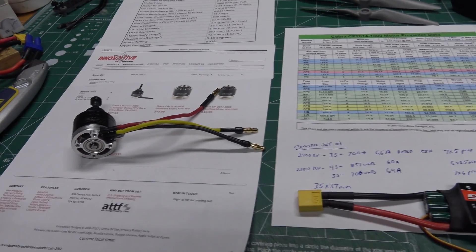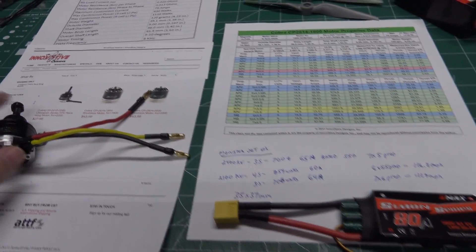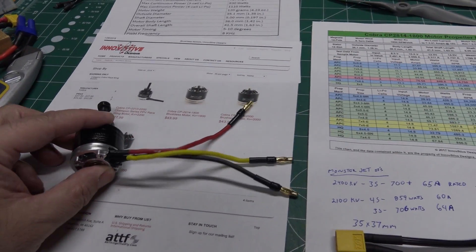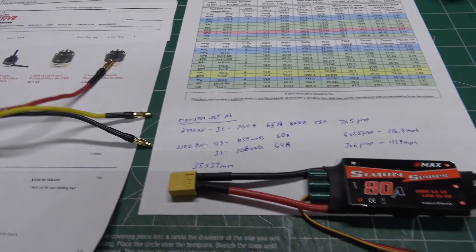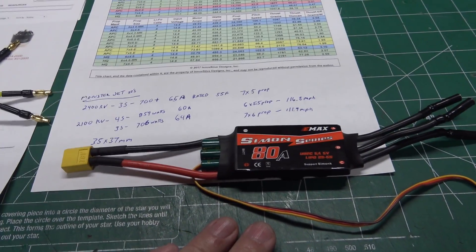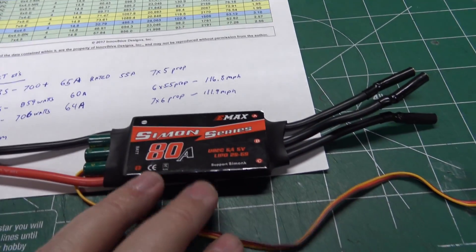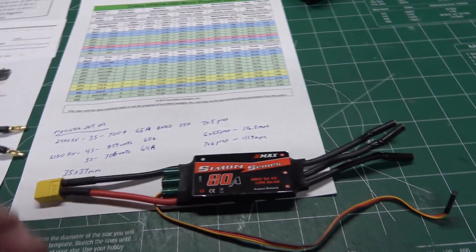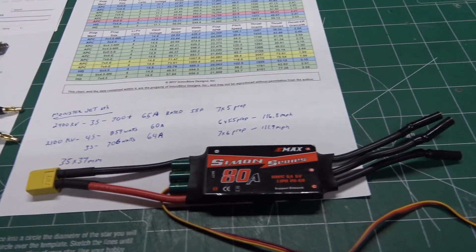For today's test I'll be running this motor. You'll probably need at least an 80 amp ESC with maybe 90 to 100 amp burst. I'd really recommend getting either a BL Heli format ESC or a Simon K format — those can support higher RPMs on high-pole motors.